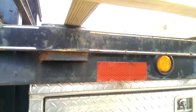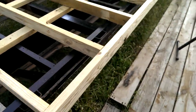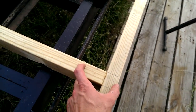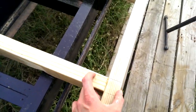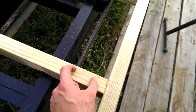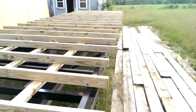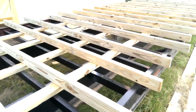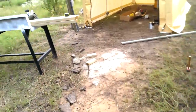So that's 62 pieces of angle iron that I'm gonna be sticking on there. It'll have a two inch overhang past the angle iron. The wall itself is gonna be three and a half inches — standard two by four. So it'll be overhanging by about one and a half inches on the angle iron, putting the weight down. I've already cut all these to 108 and 7/8 inches and got them laid on there, and I'm just pre-loading all my screws over here on this table before I stick them up.